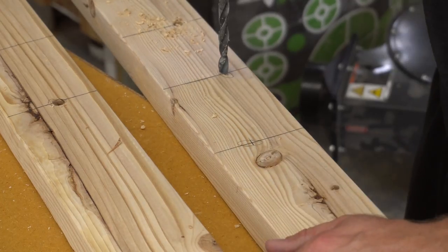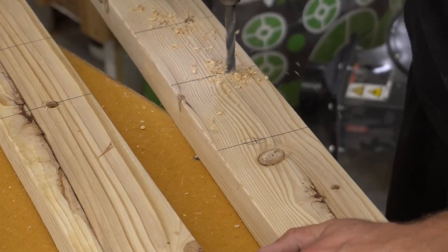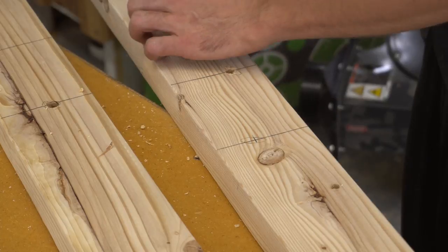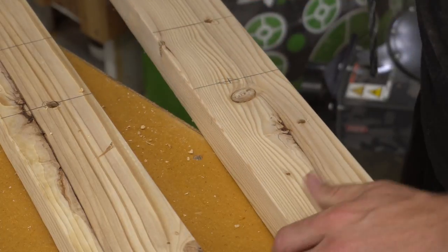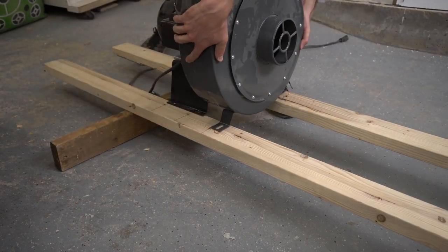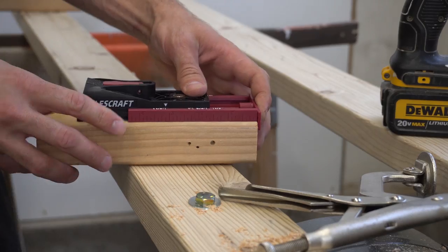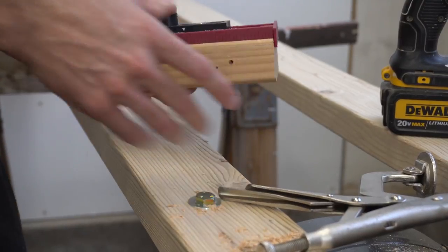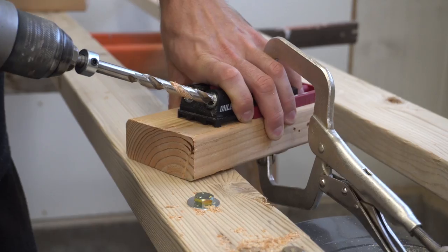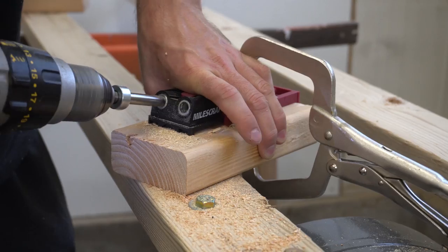3 inches! That board is 3 inches! Are all of my boards 3 inches? So you don't even need a tape measure anymore! Then I set the motor and blower assembly in place and bolted it to the 2x4s. I flipped the whole thing over and set it on sawhorses so I could add some cross braces. I just used some pocket holes and some short pieces of wood from the backside so that everything would look clean once it was mounted on the wall.